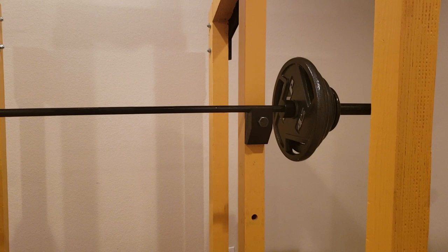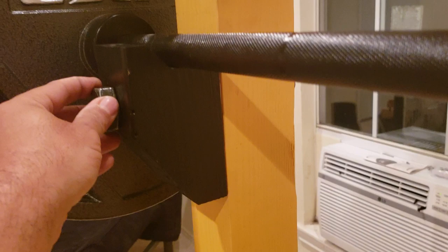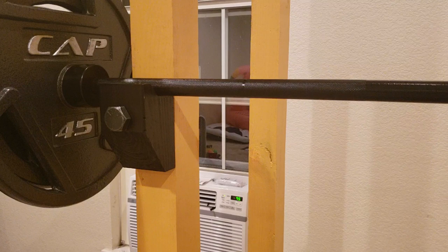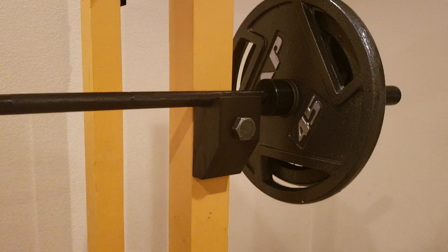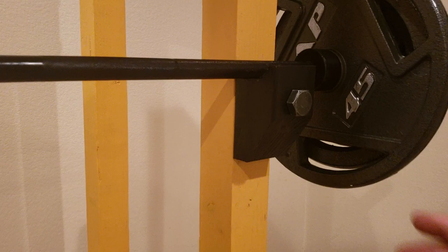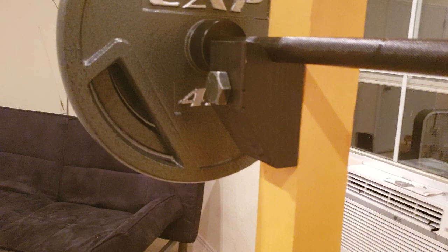The J-cups are also 4x4 that have been cut into this profile, and they are held to the post with a one-inch hardened steel bolt with a one-inch nut on the back end. I find that to be a much better choice than black pipe — I didn't want the bar grinding on bare metal, and I didn't trust the threads or brittleness of that metal under repeated heavy loads. The hardened steel bolt is a solid one-inch diameter.